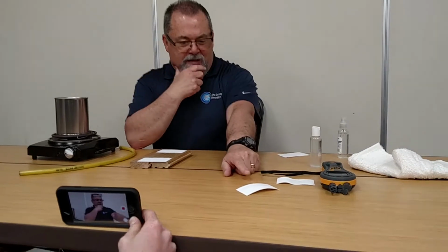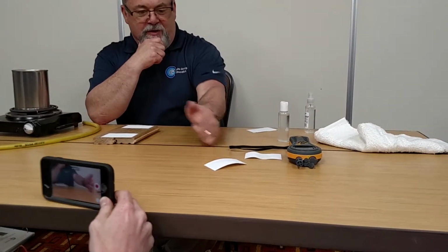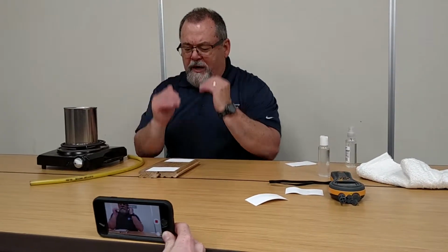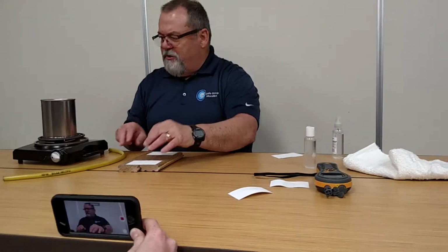So again, if you're an adjuster watching this videotape, I want you to see, oh, look at that, it's almost corrected. Good job, crown floor. And very rarely do you see a crown floor. If you see crown floor, usually somebody sanded a cup floor before it was dry, and when it did dry, it went convex on you, okay? But I want you to see what we're going to do instead.